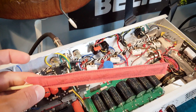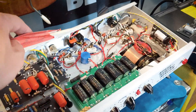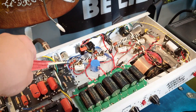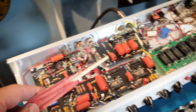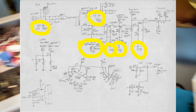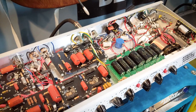Pro tip: next time you get Chinese food, save an extra set of chopsticks — because when you're working around a live amp you never use your hands, since your hand is conductive. So with one hand in my pocket and a chopstick to poke around, I was trying to find where the buzzing was coming from. I started unsoldering and moving grounds around, thinking it was a ground loop. I rearranged the ground a bit more like on my other amp. After doing more research including referencing the Japanese schematic — which the tech at the time used to indicate ground placement — the buzzing persisted and was really starting to bug me.